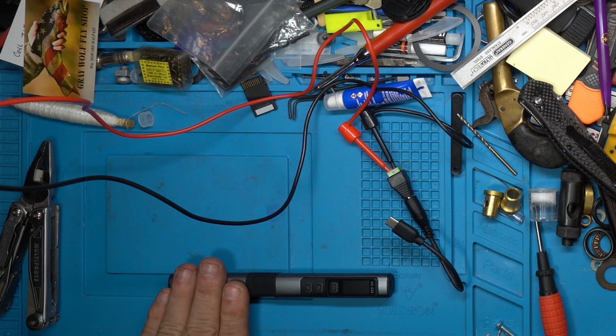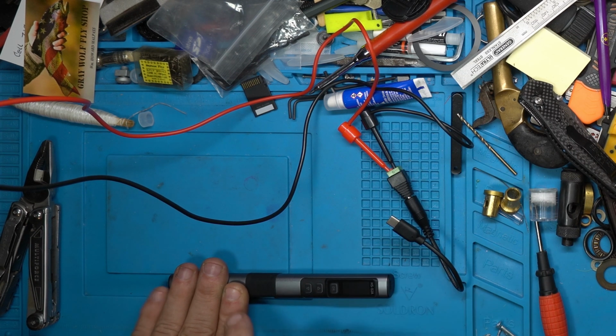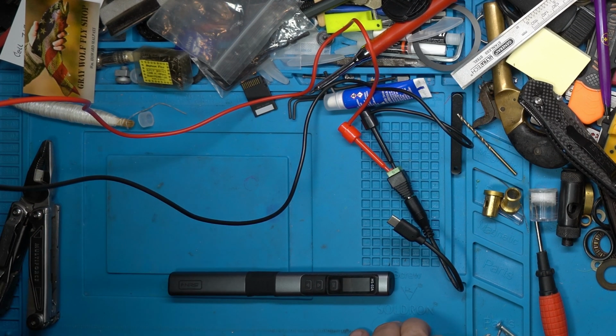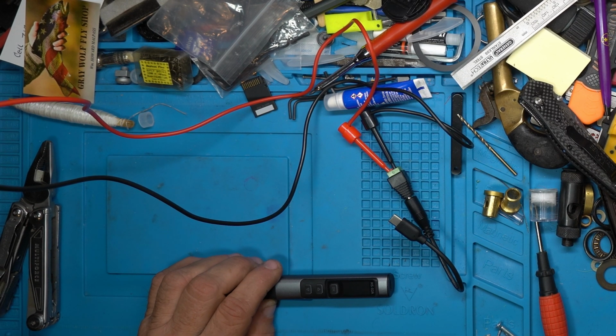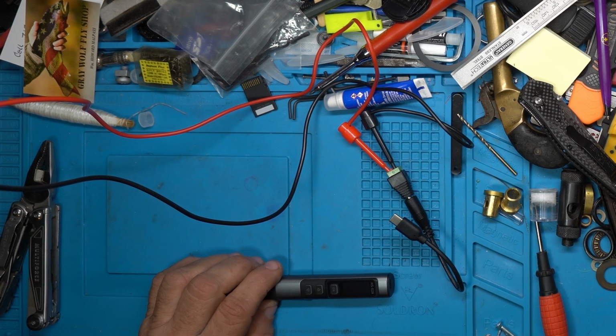This is heated up. So what I'm going to do is we're going to pause. I'm going to cut the video. I'll come back again once this tip is cool again. And I'm going to do the same thing I just did. The power supply will be set to 20 volts. It'll be overcurrent protected to 2.85 amps, and I'll have it set to 2.85 amps. And we'll see what happens. So technically with the dual channel in parallel, channels 1 and 2, it went to 3.4 amps total firing up from cold. So let's see if it trips it out. We'll be right back once it cools down.